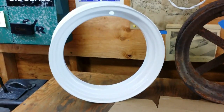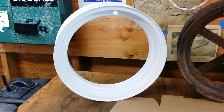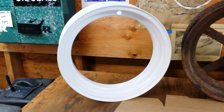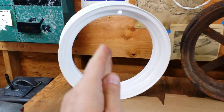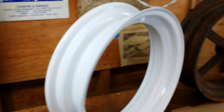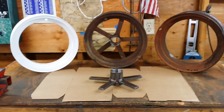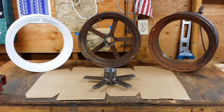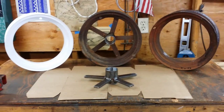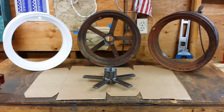Also, I'm dealing with the rims themselves from Miller Tire. They're not perfectly true. There is a little bit of a wobble — if you look at it from this direction, there's a little bit of a curve in the rim itself, so I'm dealing with that also. Basically, what I need to do is kind of split the difference of all of the little nuances in order to true up the rim as close as I possibly can.